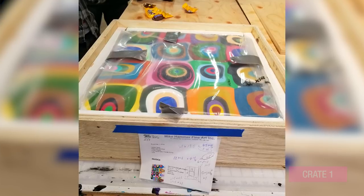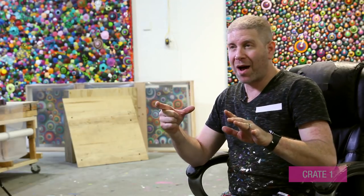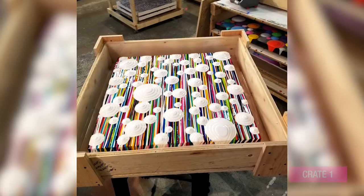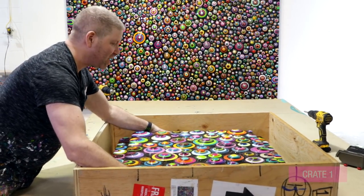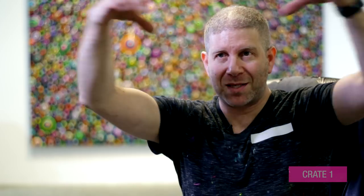The first crate I'm going to describe is the small one. For all the frames, you use three-quarter-inch plywood consistently — plywood instead of a one-by-six pine, which is not as strong. First you measure your piece and create a frame that is about six inches longer on each side. So if the piece is a 30 by 30, then you set the outer frame to be 36 by 36. That leaves about two and a quarter inches on each side for play, so you can easily get your fingers underneath the piece.